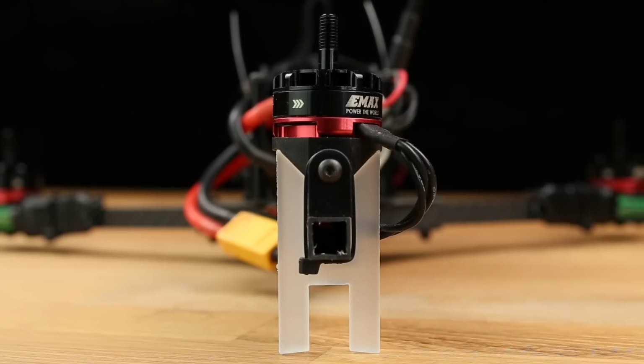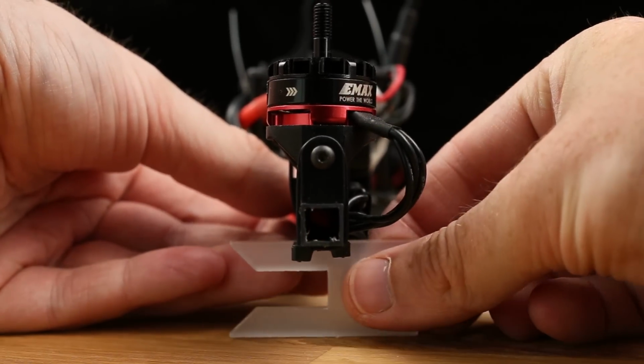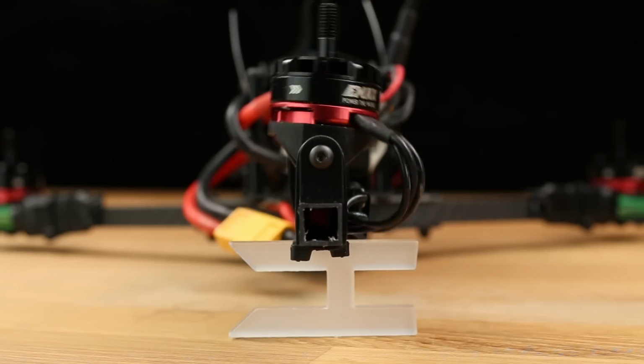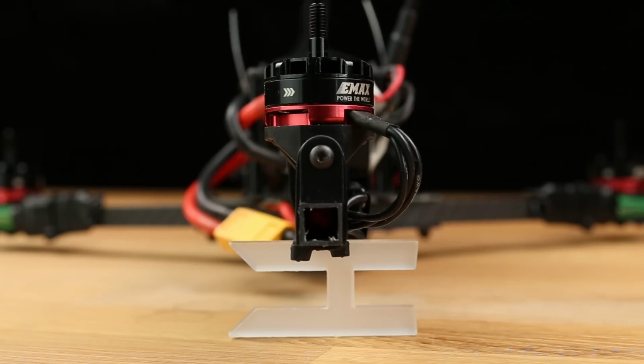You're almost done. We just need to do one last thing. Pull out the servo setup tool and turn it 90 degrees. Put the boom on there. Make sure that no wire is going to touch anything. Then move the elevator stick downwards. This triggers the servo speed measurement. Once it's done, it's going to make these tones. This means that all your settings have been saved.